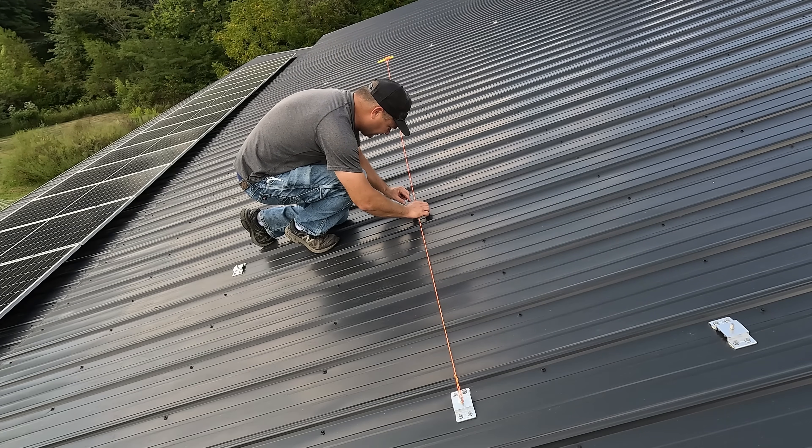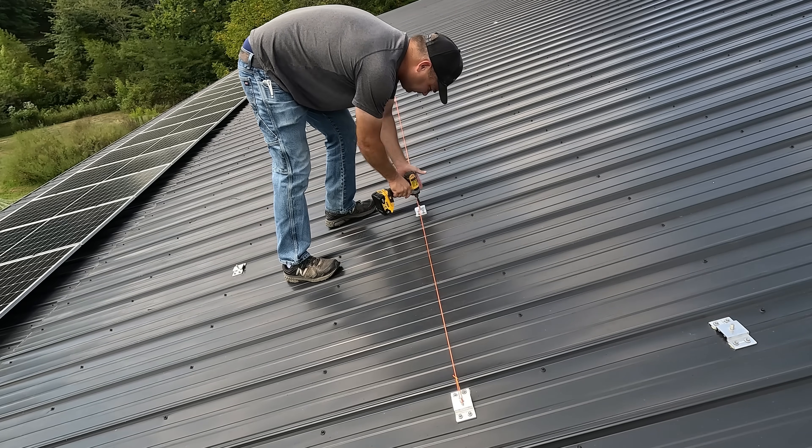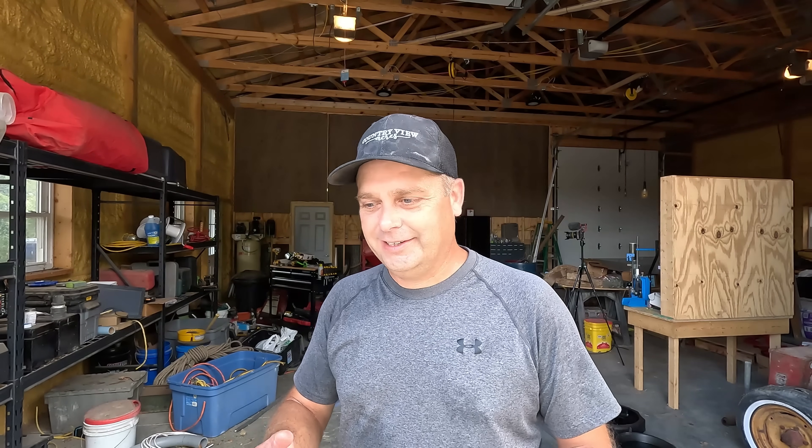These brackets are getting placed every four feet and they should be right on top of a truss. All of the mounting feet attached to the roof just fine except for one — the left-hand screws missed the two-by-four I put under the roof for additional bracing. That was my mistake; I should have used a two-by-six instead, which would have had a wider surface area. So I'm going to get back up in the ceiling, take the two-by-four out, replace it with a two-by-six, and then all four screws should attach like they should.